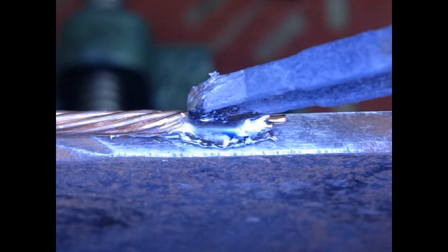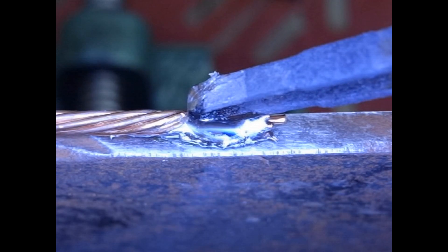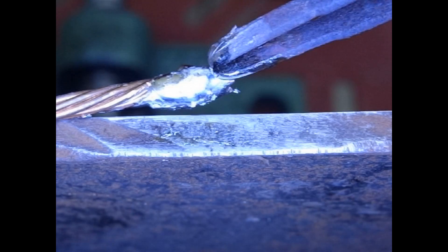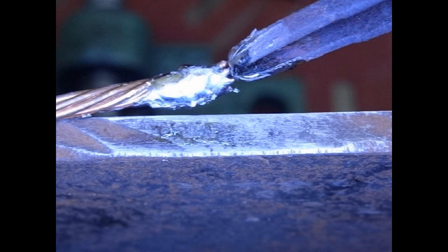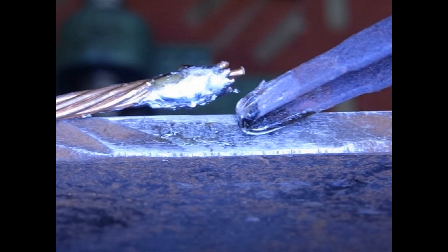I've got a 10mm wire sitting on top of a 6mm iron plate — nice shiny clean copper on a sanded-off clean spot on the iron plate. I don't think it's going to happen. I could sit here all day long holding this 1,300-1,400 watt soldering iron on here, but I just don't have the heat. There's not enough heat coming out to bring both the copper and the iron plate up to the temperature of melting solder. Iron prefers an acid flux, and I've used it on gutters and that works fine.